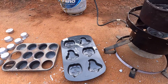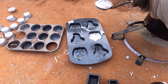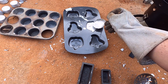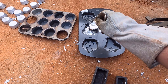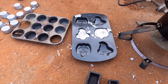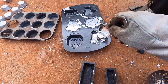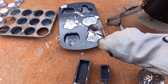I know it's a little late for Halloween but I preheated this pan a little bit. Let's see if we can get a couple of these to come out good. Hopefully it won't have pour lines in it. The first ones I did had some pour lines in them because the pan wasn't warm — the pan should be warm now. These cast iron molds have been leaving pour lines in them because they still haven't heated up even though I've poured three or four times in them.